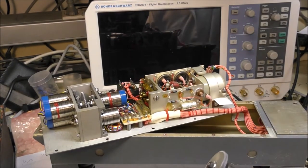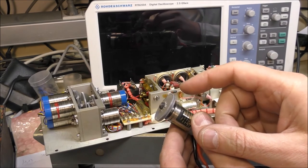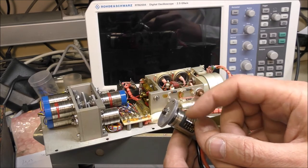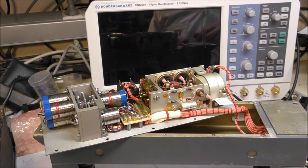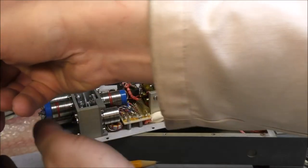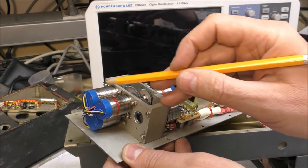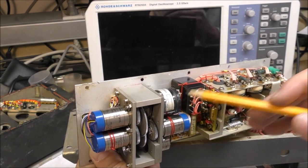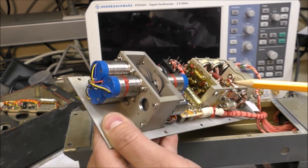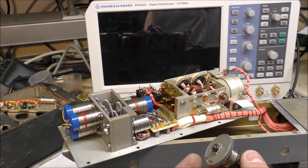Now let's turn on the power supply. You can see that the servo control works. The input of this servo control amplifier is normally connected to the synchro transmitter, and this permits a copy to three synchro transmitters, which can drive different heading indicators and also an autopilot system. This thing may also be a potentiometer. Without any reverse engineering, it is still possible to make it work.